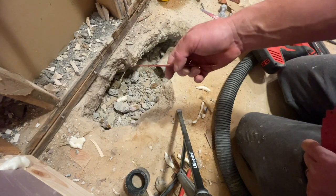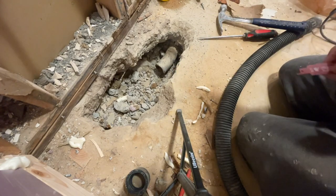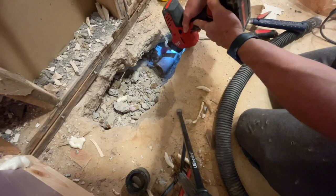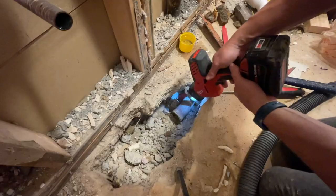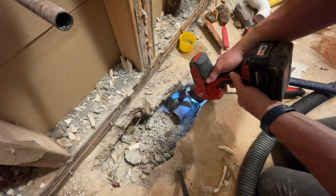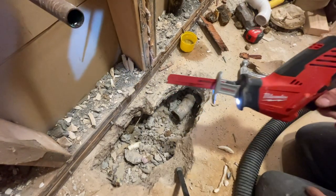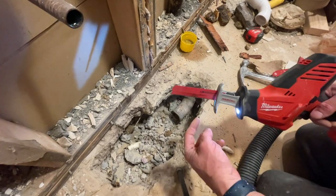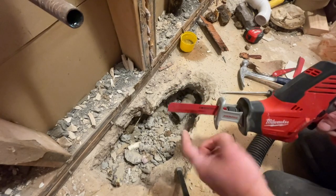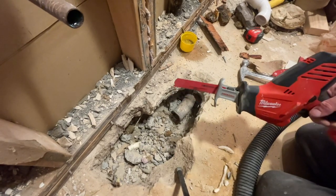I have two metal blades for this — I've got the thicker blade and the thinner metal blade. I'm going to try the thinner metal blade first and see how tough this cast iron is. Sometimes the cast iron is not very tough and you can use a smaller blade; if it's a little tougher we've got to go with the big heavy-duty blade. Slow going, so settle in. When you do this, you don't want to force the blade — let the teeth do the work. I made a little notch with the skinny blade, then went with the thicker blade. Instead of cutting on one piece of pipe, I'm basically through the cast iron, cutting the top and the bottom of the pipe. It's a little trick I've done over the years. I started in the trade working on a lot of cast iron so I'm very familiar with it — let's continue to cut.